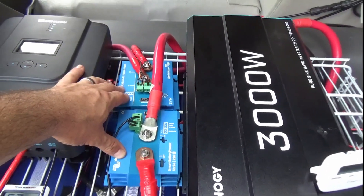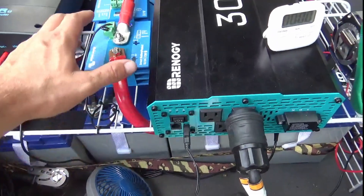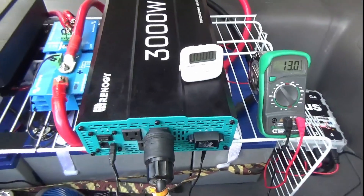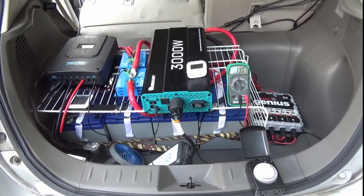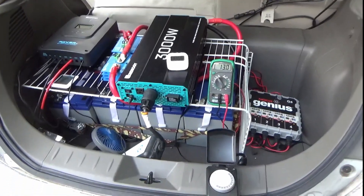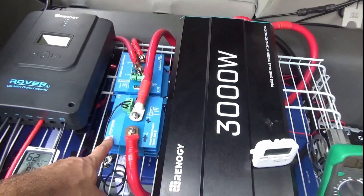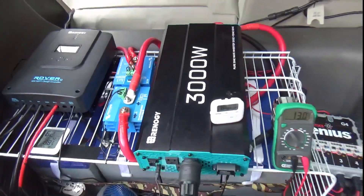When it drops to 11.8 volts, these will cut off the flow from the batteries to the inverter. And when the solar panels charge them back up above 12.8 volts, these things actually reconnect the current flow and the whole system turns back on. The end goal we're working toward is a system where I can get home on Friday night, the car batteries are fully discharged, we plug it in and walk away — no eyeballing the sun, no guess-and-check like with the timer. This will turn the inverter on and off, essentially turning the car charger on and off, keeping the charge in the battery within that healthy range.